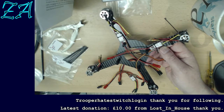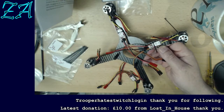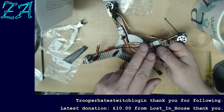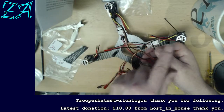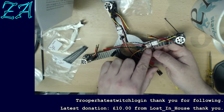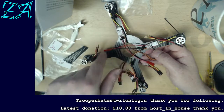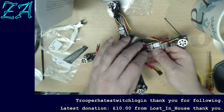no, Free, because these types of controllers just work from off to full on. There is no reverse on them. You can get speed controllers that work in, say, model cars or boats, where they'll go from reverse to off to full forward, and it actually does cause the motor to spin backwards, because the motors don't really care which direction they're spinning. But for aircraft, they're always forward only speed controllers. And all 4 speed controllers will get the same signal. They kind of do. It's not as though they're sent one that says go backwards, because they just don't have that capability.